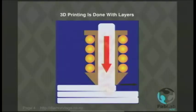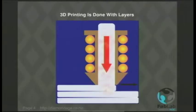So how does our wondrous 3D printing stuff work? Our little machine is basically a glorified computerized glue gun. Plastic is pushed through a heated barrel which warms up and pushes it out. The residual heat in the plastic and the heat conducted through by the nozzle fuses the layer above to the layer below, which is why it's called fused deposition modeling — which is a trademark of Stratasys. So we call it free-form fabrication instead.